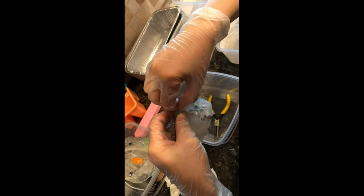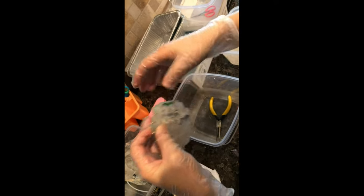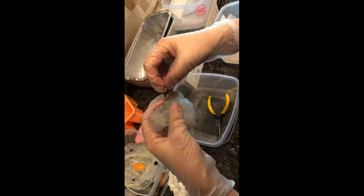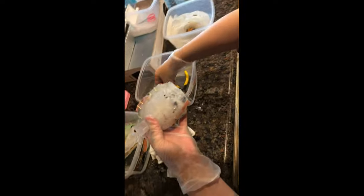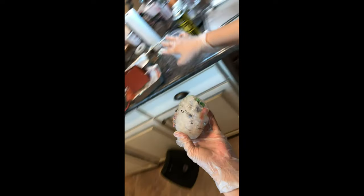When I first started going live, I went overkill with the protective clothing, because I'd been working with silicone every day for the last 6 months, and I developed a bit of an allergy to it. And every time it touched my skin, I ended up with dermatitis and it spread to my face. So I was like, okay, even if I wear a mask, at least it's covering it up. And I started wearing masks, hoods, sleeve covers, everything, because this stuff gets everywhere. And if my hands are sticky, it transfers to switches, it transfers to all the clamps, it transfers to everything, and it never cures, and I end up transferring it everywhere. So when I finish, I have to, you know, go over everything with alcohol and try and get rid of as much residue as I can.